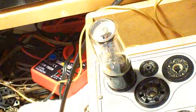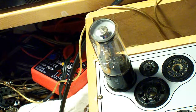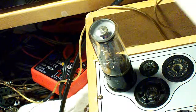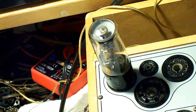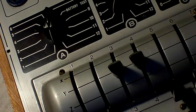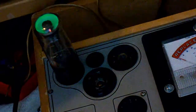So — open and close right there. Reading the manual for the eye test: it says to set up per the roll chart, and after doing the short test, set all switches and levers as indicated, press the read meter button, and observe the fluorescent screen which should illuminate completely — we did that and it does. Next it says throw the first of the two levers indicated under the Y setting to the Z position. So the two levers should be up in the Y position, and we throw the first one down to Z, which gives us our first indicator — either open or close — and that's open.